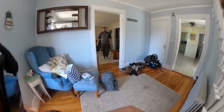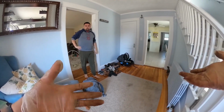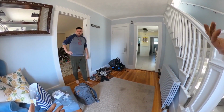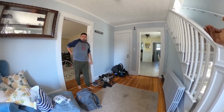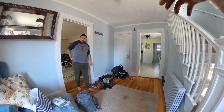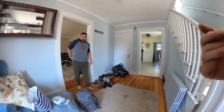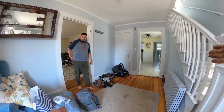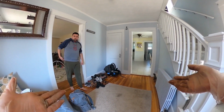So he just wanted me to let you know, since we are in an older house and you have that drum trap, there's no guarantee that something might not happen to the pipes. In other words, if we go to snake it, it could break it. Where we found that drum trap, we're going to try to take the cap off and see if we can snake it through there. But there's no guarantee that we're not going to poke through the pipe, because we don't know if they're lead pipes or not for the drains.